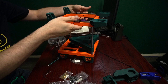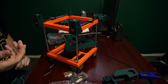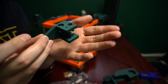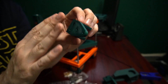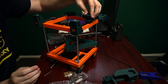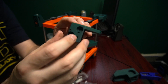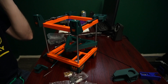There we go — gantry assembled with idler towers and motor mounts. The next step is attaching the Y carriages. For the MK 1.1 revision I've modified these — made them smaller and removed the side to make it easier to get bearings in. I definitely recommend printing these very strong: about four walls, 30% infill or so. These mount to the linear rails with M3 by 6 millimeters — three per side. They have holes in the top so you can get your allen key directly through the top of the Y carriage.